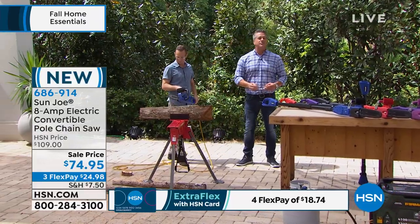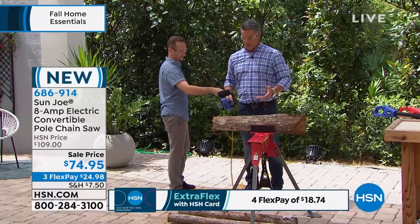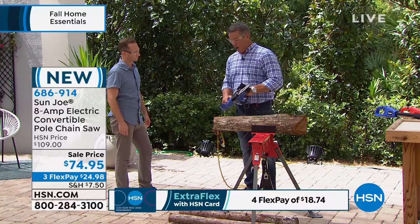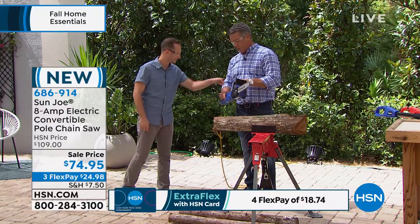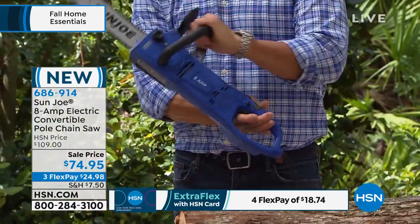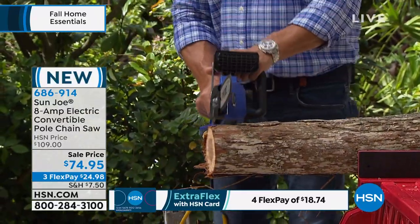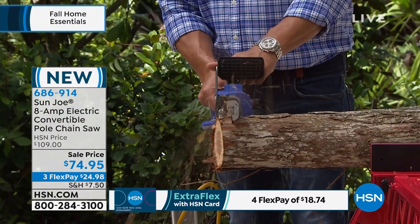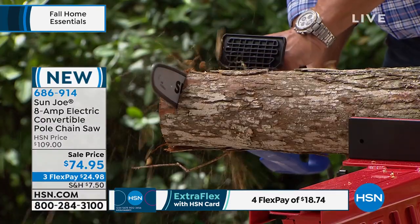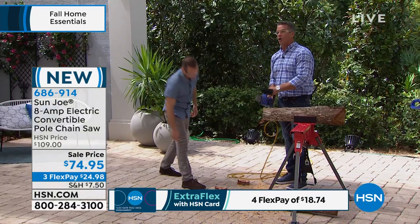I'm going to put on my protective goggles. It's always good to put on your protective eyewear. We have a lot of built-in safety features, but if it's a tree, you don't want a little piece of it to fly off and get you. You want to hit the buttons at the same time — there's a safety button on the back. You have to put your thumb on there and squeeze the trigger at the same time. Then let the saw do its work. Just let it flow. You don't need to push it. Drop your hands a little bit as you go down — it's got torque teeth to push down.